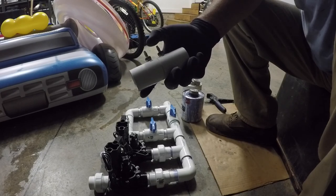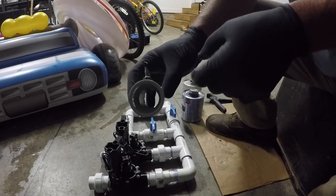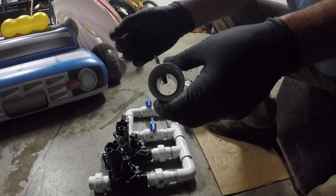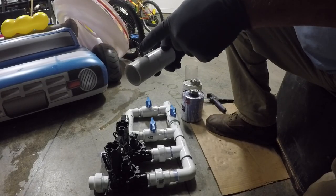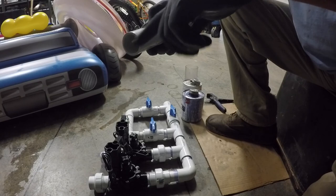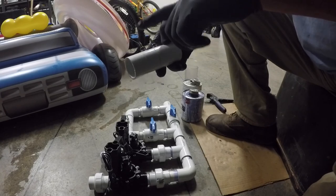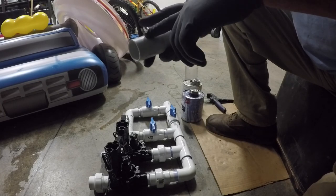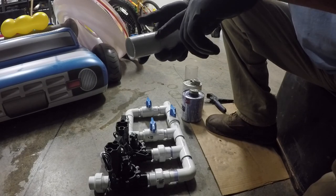But anyway, the water flows through here, and you can see these little nipples here. The water gets pushed up through the nipple, goes through a line, goes into a container that has a concentrated fertilizer in it, and it pushes it back into the other nipple, sending it through. So as you're putting out water, it's dropping out a micro dose of whatever, mainly nutrients, fertilizers, organics, humic acid, fulvic acid, stuff like that. You do not dare want to run a herbicide through this.